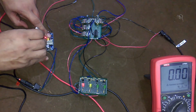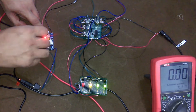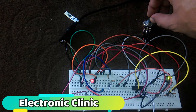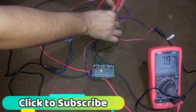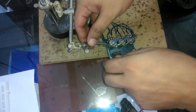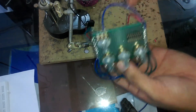In today's episode we will be making an LED battery level indicator without using a microcontroller. This LED battery level indicator can be used with all types of batteries. In this tutorial you will learn how to use a voltage comparator LM339, its basic working principle, how to set the trigger voltages to show the exact charge percentage, and then how to make a final circuit. This same circuit will also be used in making a stabilizer in upcoming tutorials. Let's get started.